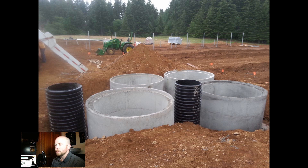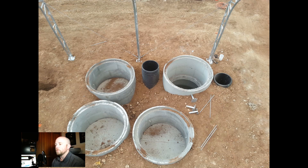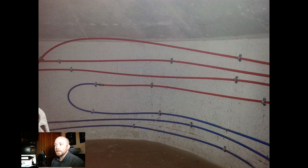All the storage tanks, the neck, and the digestate tank are in place and we're backfilling more. The solar posts are in as well. To keep cement costs down, we poured everything in about two days. Inside the digester, we're stringing PEX piping connected to the building's heating system, because the bacteria like it warm and we need to both add heat to and extract heat from the system.